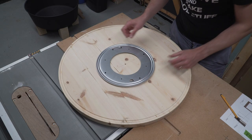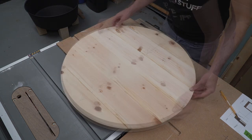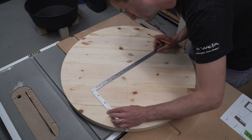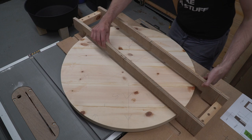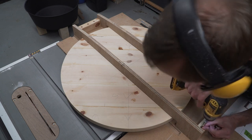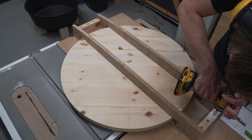Using centre marks on the base of the cover, we secured the Lazy Susan with a few short screws. Then we marked a cross on the top surface of the cover. Now we can bring in the magically assembled router jig and align it to the cover using that cross to keep things centred. The important part of this jig is that the Lazy Susan, cover, and jig must all have the same centre point. We then screw the jig down to stop any movement.